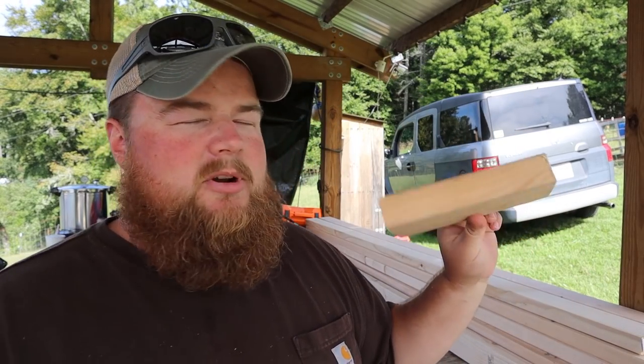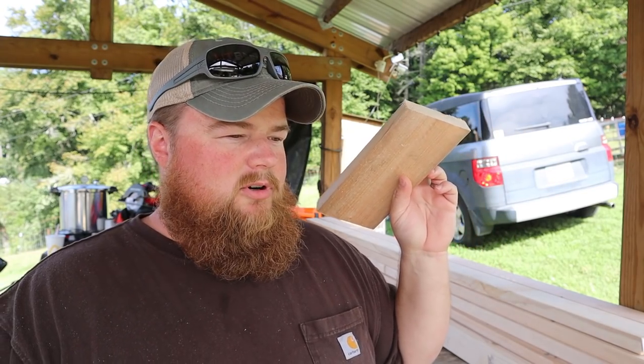I have all the rafter tails cut for the full-length eaves members. Our house is about 75 feet long, but I've always budgeted for 80 feet. With 8-foot eave sections, that gives you 10; account for overhangs and other weirdness, take a couple away. So I'm going to start with making 16 eave widgets, and then go from there. Hopefully at that point I'll be left with less than an 8-foot span and can cut custom ones for each end.